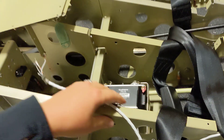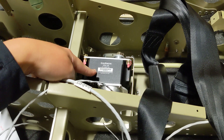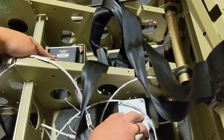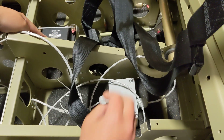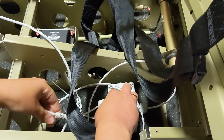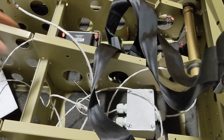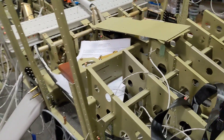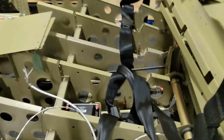The autopilot was a bit tricky because Garmin wants to control the trim servo. So we brought the trim servo out to a breakout box, broke out all the wires, and gave the power wires to the Garmin so it could control and move the trim servo. We moved the position wire forward — we've got our trim position wire going all the way to the panel so that Garmin can control it.